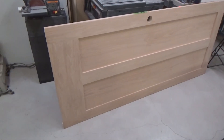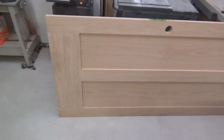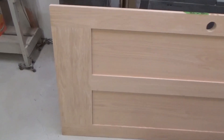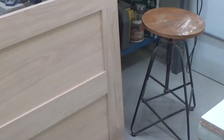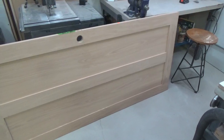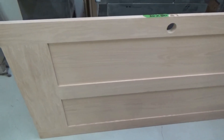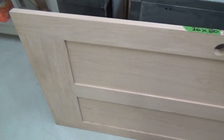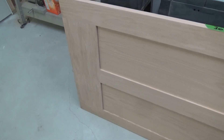What I'd like to do is trim it up and keep it symmetrical. Right now it has a wider piece at the base of the door and a much narrower piece up at the top. I want to get those to be the same. The tricky part is probably going to be maintaining the dados for the inset panels — that's going to be my challenge to overcome today.